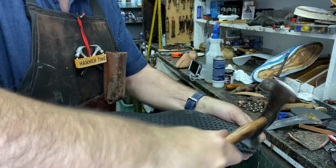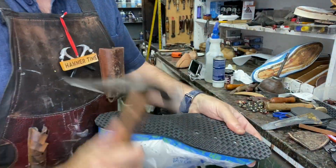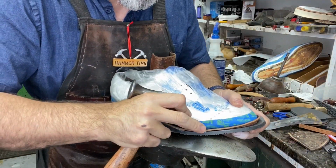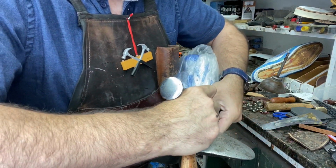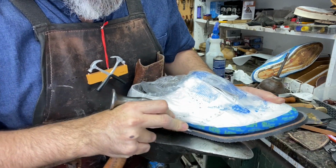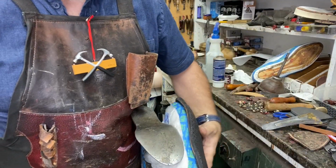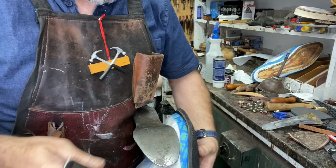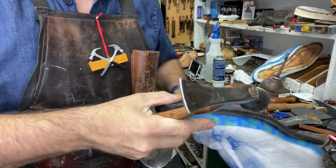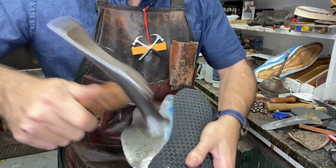the glue, because the glue is not really meant for plastic. Okay? So what I did was I put a top coat of super glue on the plastic, let that dry, and then put all-purpose Masters all-purpose cement, let that dry, and I heated it up, and then together. So that should work pretty well, rubber sticking to plastic.